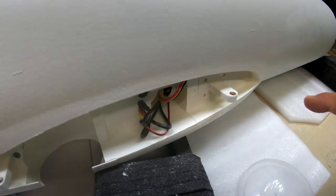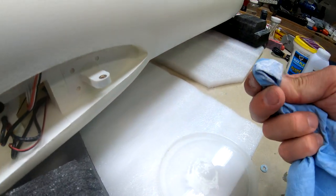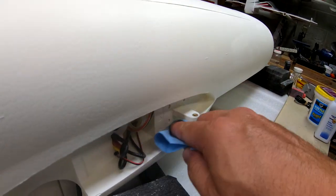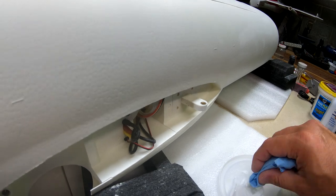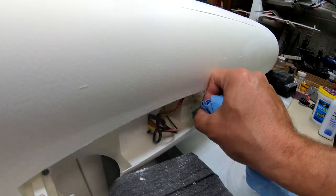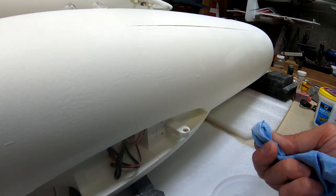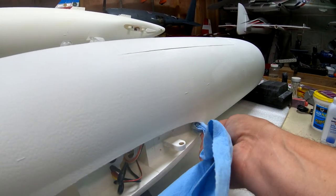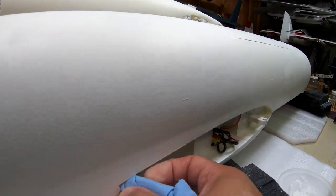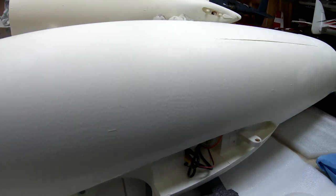And all you want to simply do, so that I'm not pulling up that underlying paint here for an example, is you just take this rag and you just take some of that baby powder and you rub it all over the surface. And no, it doesn't change the way the finish looks. It actually seems to help make cleaner lines because it fills in some of the imperfections. But whatever is on there, and I mean, you're not leaving coats of this stuff all over the place, but basically it's filling in any of those imperfections, but it's giving the tape the baby powder to stick to, and it seals it off perfectly. And when you go and lift, it will not peel it.